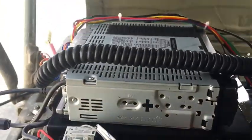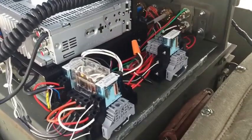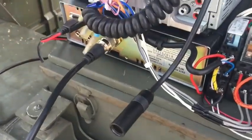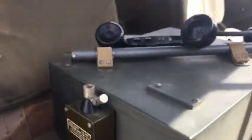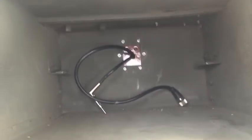And then the antenna, oh, I meant to hook up that SWR meter. The antenna, see, I've got it plugged in here, but usually it fits right in here in the back of the casing. And then it actually splits off into 2 wires. One's for the car stereo and one's for the CB. And it works. I've got excellent SWR.